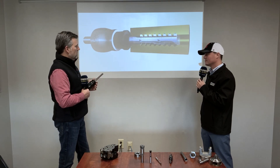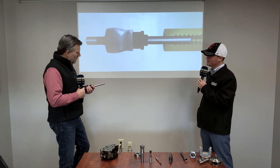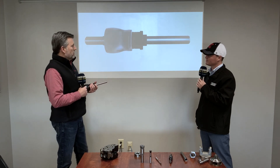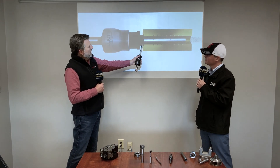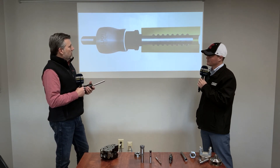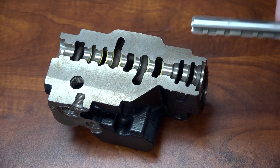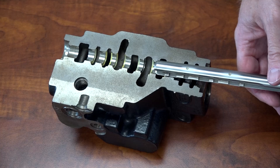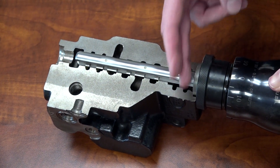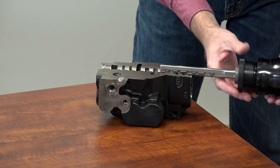In terms of accuracy, on the customer part we're generally seeing axial positioning of the cuts held to plus or minus four to five thousandths of an inch — that's pretty common. Obviously we're manufacturing the tool to much tighter tolerances. On diameters it's usually a little more open, because the position in the bore is what's critical; diameters are usually plus or minus ten thousandths.